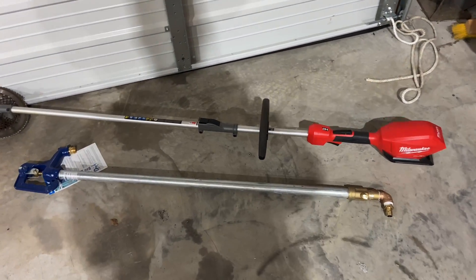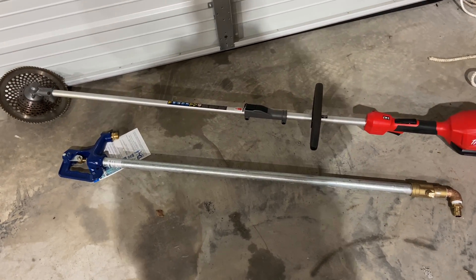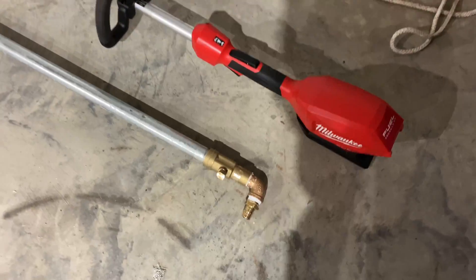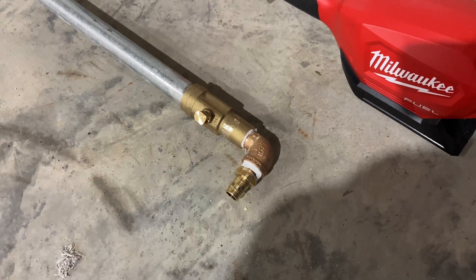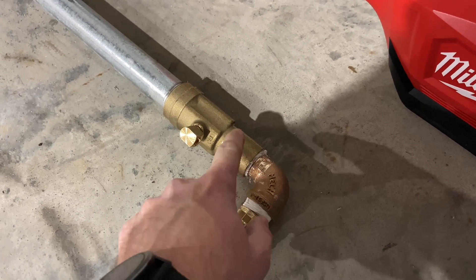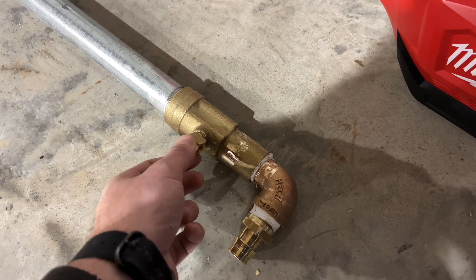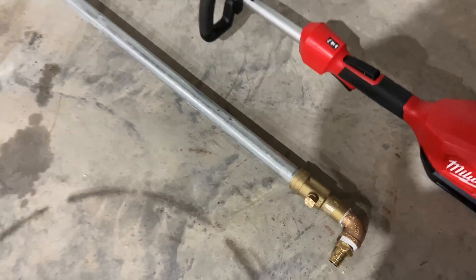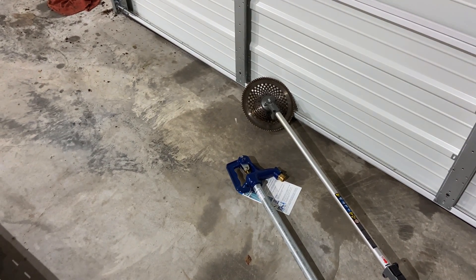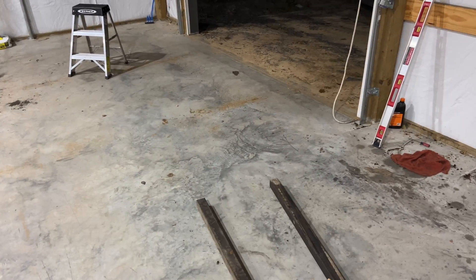And the last thing: putting in a water hydrant for the water service so we can have water access to the property — mainly so we can pressure-test the drain waste vent plumbing when the time comes. I just bought the cheapest hose bib I could find and made up these fittings, adapting it to PEX. I've got a three-quarter inch male, a brass street elbow, and a three-quarter inch in here, and this had a little eighth-inch port for the weep hole. So I will keep you guys posted as more progress happens. Thanks for watching and have a good one.